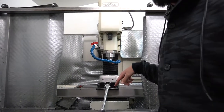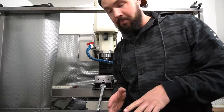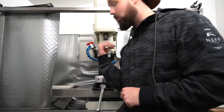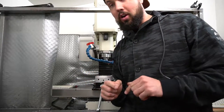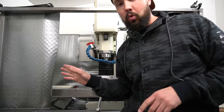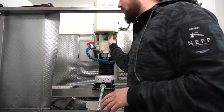A lot of the engraving that I do — and all the engraving we're going to be doing tonight — is going to be here on the Tormach. When I was buying a Tormach I thought for the longest time that I wanted an 1100, but I'm so glad I didn't get it. Back in the day the 1100 only had like a 6,000 RPM spindle. I didn't know back then that engraving was going to require so much spindle speed. I'm so glad I got the 770 — this guy can run forever, not get hot, not get overworked, and it runs on 110 so it's not using hardly any electricity.